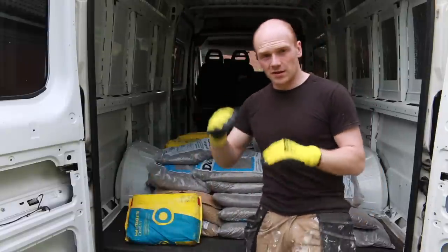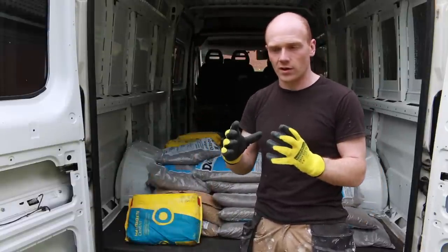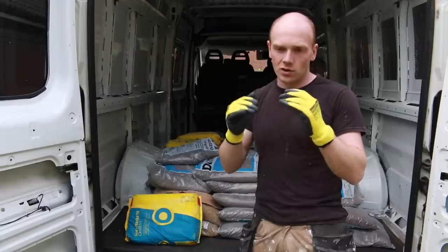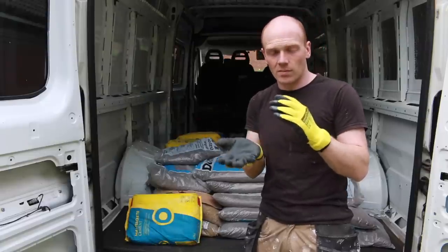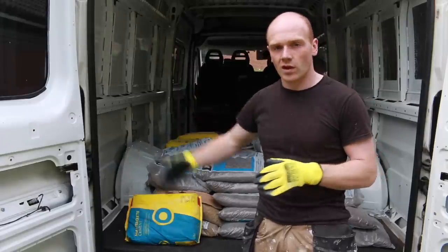And what that'll do is just provide almost like a mini soakaway at the bottom. And also that gravel is going to help me level up all the sleepers before they go into the concrete. So I can use it to pack up some if I want them higher, go a little bit lower on some to get that even sort of curving that we're wanting.